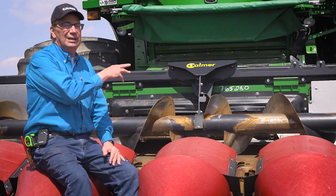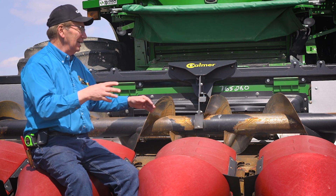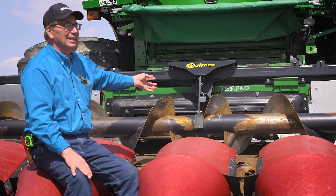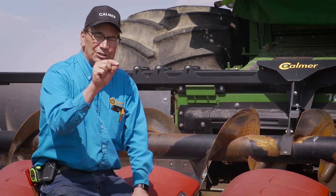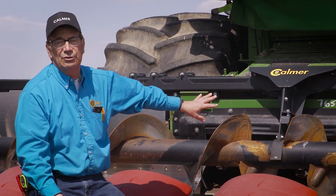In the old days with the older green combines we used to always see a lot of ear tossing. Simply, the pile of ears got too high during handoff and then the auger flighting would just grab that ear and flip it out onto the ground. On a red combine, feeder chain speed and corn head speed are one and the same. You slow the head down, you slow the feeder chain down, and we get a little bit more boiling, especially on the newer flagship combine.